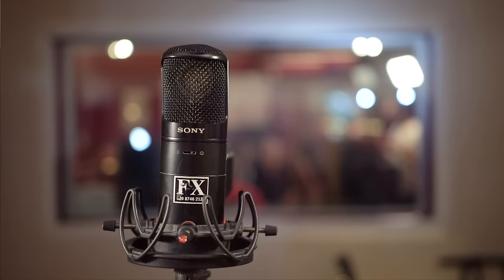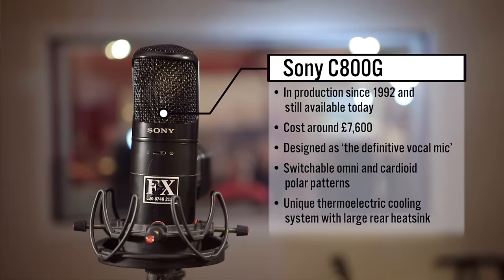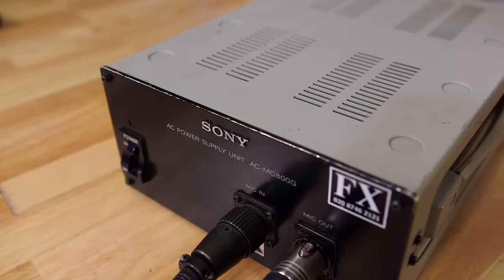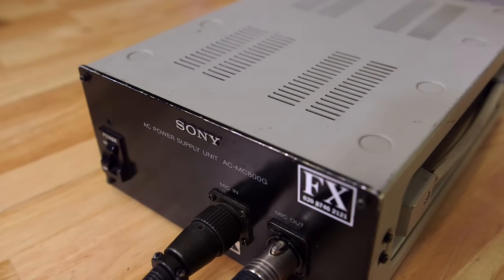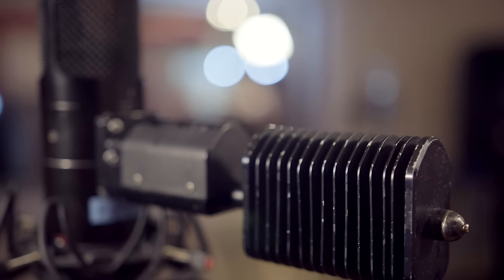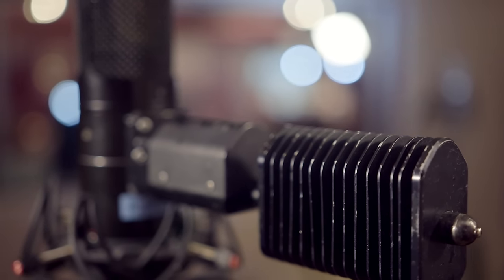In this test we're comparing Sony's C800G microphone, which was introduced in 1992 and was intended to be the definitive vocal mic — a cost-no-object microphone. It has the largest power supply of all the microphones we've tested here. It's also the only one you can buy new today, and it's also the cheapest — believe it or not. In the UK this microphone would set you back around £7,600. It's unique in that it has this rather strange cooling fin system at the back. It's a valve microphone, and the idea is that this Peltier thermoelectric cooling system keeps the valve cool. You have a semiconducting layer with metal plates either side, and putting a DC voltage across the semiconductor makes it act as a heat pump. The heat sink remains at room temperature while the inside gets slightly cooler, reducing noise and generally improving performance.